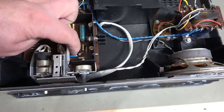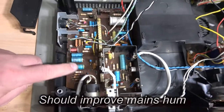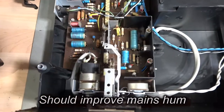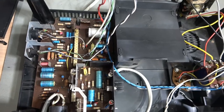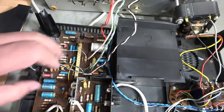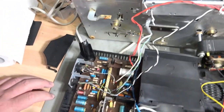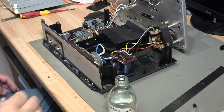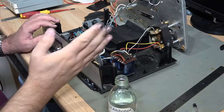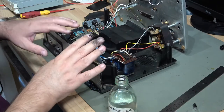The board itself is a resin-impregnated paper board — very old-fashioned. We've got the usual set of electrolytic capacitors, all of which I think I'm going to replace. This one actually looks like it's bulging a little bit — the seal on the end is pushing out. Most of it looks okay. The good news is these are readily replaceable transistors, mainly, though there are four germanium transistors on the output stage which will be a bit more troublesome if I need to replace those.